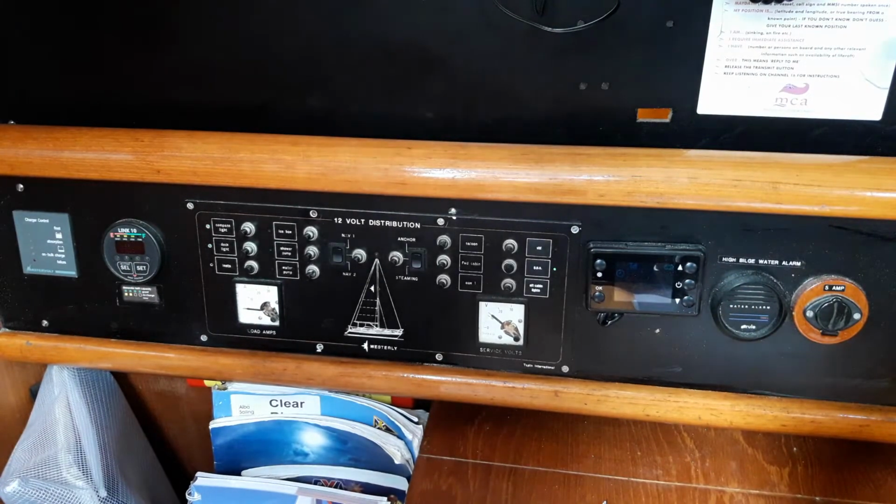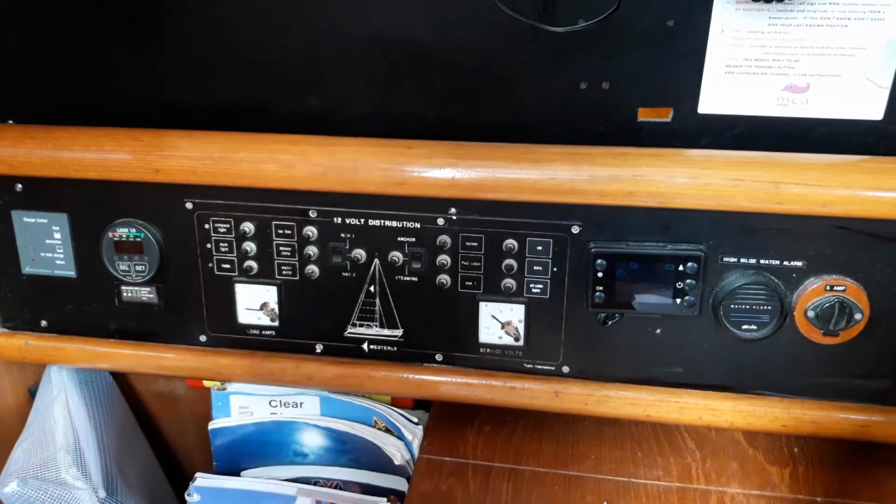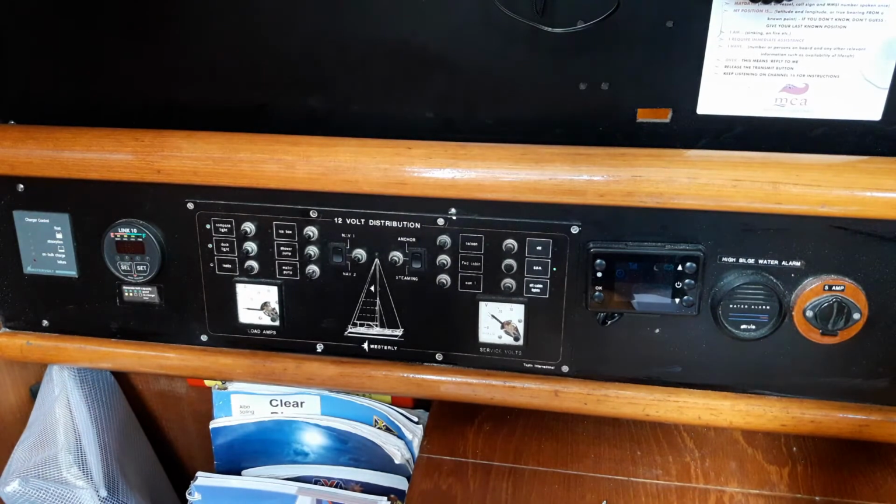These modern heaters start very easily. There is no real need to have the engine running whilst you start the heating system. It's diesel fired and only uses about half a litre of diesel an hour, and is a blown warm air system, and there are outlets throughout the boat.